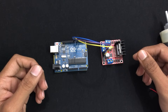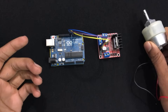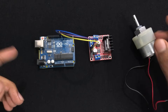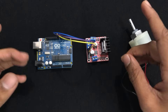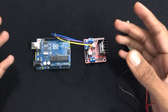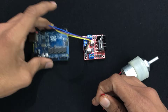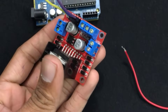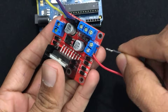Now it's time to connect our DC motor to the motor controller. Here I am using a 500 RPM 12-volt gear DC motor. You're free to choose any other DC motor, but make sure your motor is rated according to the voltage you supply. For example, if you are using a 12-volt power supply you must use a 12-volt or higher rated DC motor — using a 9-volt DC motor with a 12-volt supply may damage it. To connect the motor, take its two terminals and connect them to the screw terminals OUT1 and OUT2 on the motor controller. Here I am connecting the red wire to OUT1 and the black wire to OUT2.